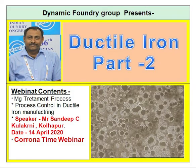Third case where sulfur is low and tapping temperature is also low, so you require only 5 kg, that is 1% of magnesium. Again here sulfur is a little high but tapping temperature is also high, so you require 5.6, 1.1 kg, 1.1% of magnesium. So these are various examples I have just put up here. Then we go to metal tapping.